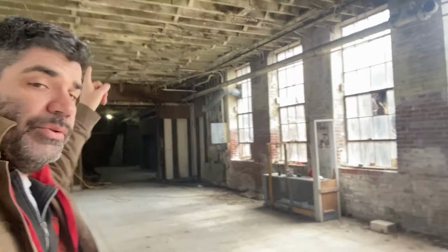But that vertical shot from the ground floor to the elevator shaft, just that vertical space is about 40 feet. And that copper wire, especially at that gauge, is not cheap. So once it gets down to the bottom, I'm already at, let's say, 50 feet, and then I have to measure from the place that it enters the building.